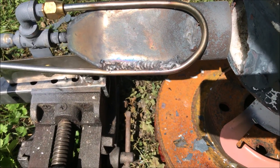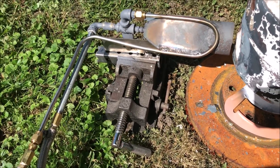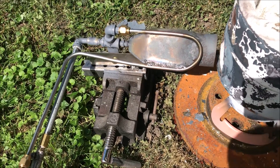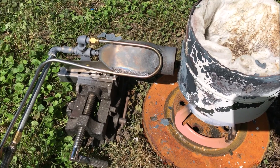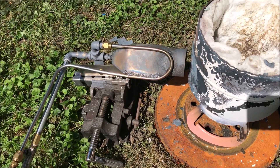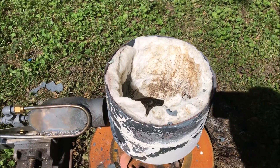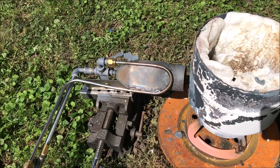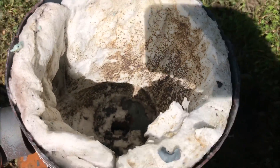This thing could even handle a couple of spatters of liquid propane entering the combustor without a problem. So it's another thing to look at, and I think we're going to give that a shot. I just wanted to do this test to be thorough, to show not only the enhanced temperatures but the cons — being the tank pressure issues and pressure drops. We were able to melt that pot in about a half hour; actually in 9 minutes we had melted glass. It's just dialing in the temperature just right from that point.